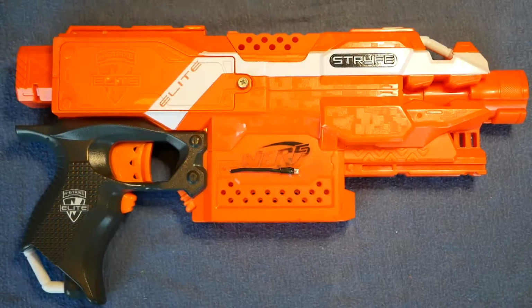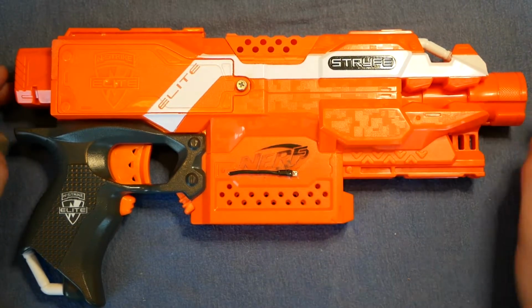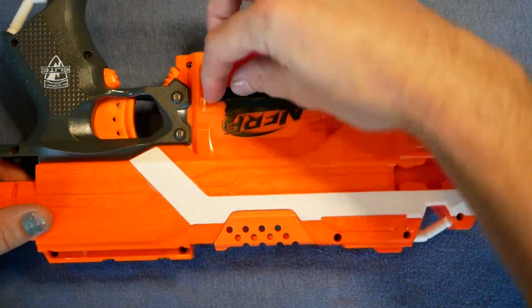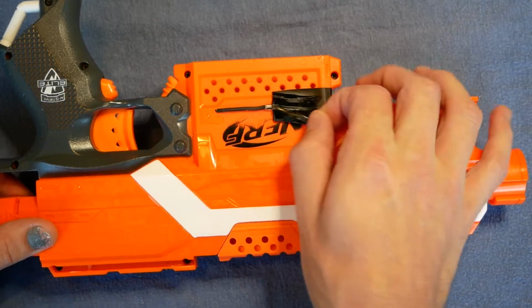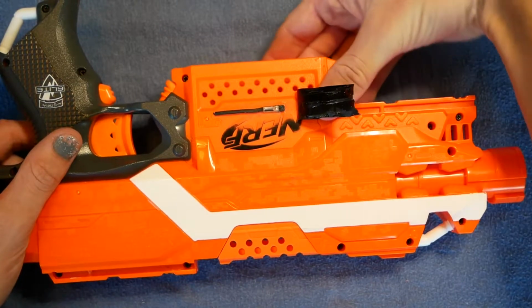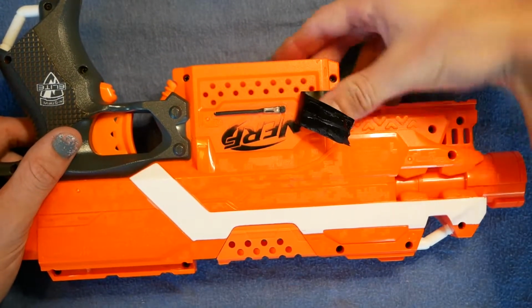amount. The Stryfe is slightly trickier, slightly messier, because the LED and receiver have to be on the outside. I've just got tape over this to block out ambient light, because of course that'll pick up a lot of infrared through the back of it and get confused. That really would need a bunch of epoxy putty over it.